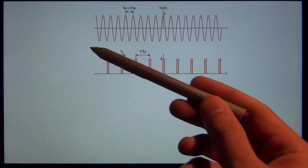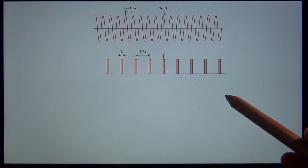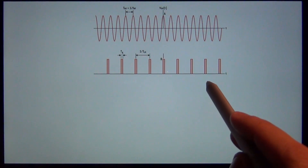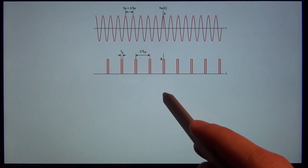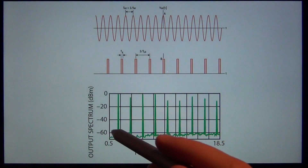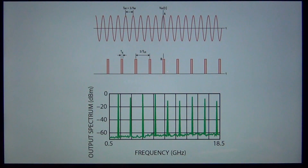Why is that interesting? It's important because of this: imagine feeding a sinusoid to a step recovery diode — you get these impulses. If we assume these impulses are ideal, what is special about a train of impulses? If you remember your Fourier transform, an impulse train has the property that its time domain and frequency domain signals are the same. An impulse train separated by distance T in time will be separated in the frequency domain by 1/T in frequency. So therefore, putting a single sinusoidal tone into a step recovery diode gives an impulse train out, which in the frequency domain is also an impulse train — a comb frequency generator. A step recovery diode can give you a whole bunch of harmonics of your input signal, which is really interesting because now you have all these high-power harmonics to do really cool things with.